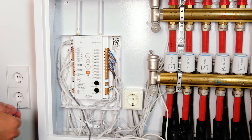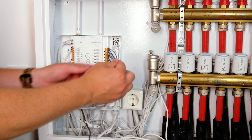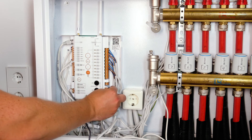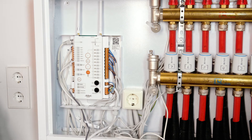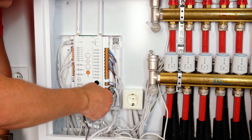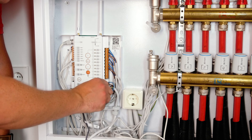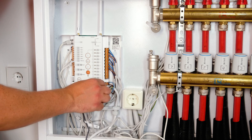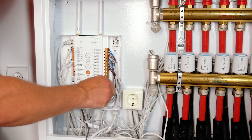After the power cable has been connected, install the power bridge for 230-volt actuator valves following the simple wiring diagram as set out in the user manual. With 24-volt valves, use an external transformer. Tighten all the connections and remove any excess slack in the cable to achieve a smart performing, smart looking, smart heating system.